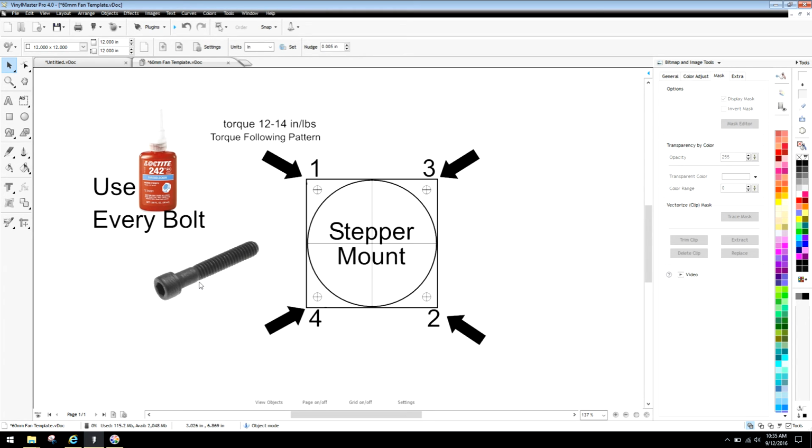The cleaner that bolt is of oil, then you can rest assured that bond is going to be amazing. And don't be afraid of throwing some acetone in the holes either. Let that oil penetrate and remove as much oil out of all of those holes as possible so that you're getting this bond as strong as possible. That's really what we're looking to do.